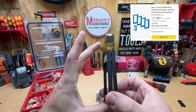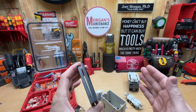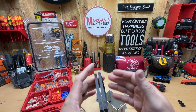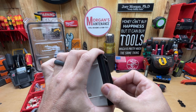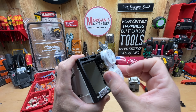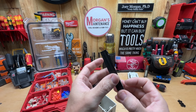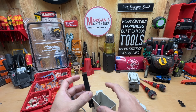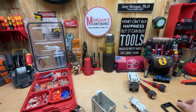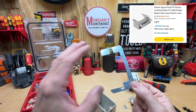There are also box spacers, which come in different thicknesses — an eighth inch, quarter inch, half inch — so you can combine sizes. If you need a three-eighths gap, you'd use an eighth and a quarter together. You put these on your box, it extends it out, and you install your receptacle the same way. However, these aren't quite as adjustable — you pretty much have to know exactly what size you need.